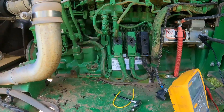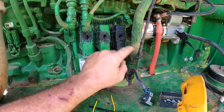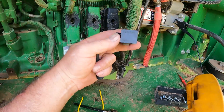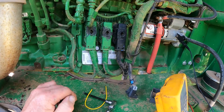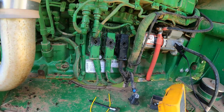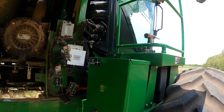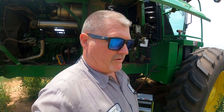It was really odd — we came back and unplugged the engine controller here from the chassis harness, and as soon as we did that, our CAN voltage came back good at our terminator. We had about 2.5 volts on both CAN high and CAN low, and our 12-volt and ground were fine. When we plugged the ECU back in it was fine, but the ECU was still offline. I do believe the lightning probably damaged the engine controller as well. We've got an engine controller ordered, but we did get all the other controllers back online, loaded software, and everything is working like it's supposed to.